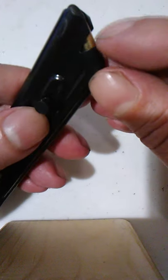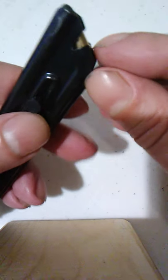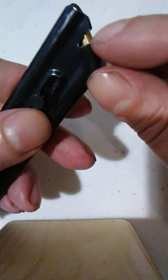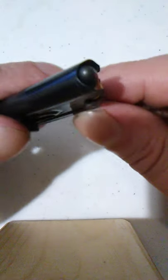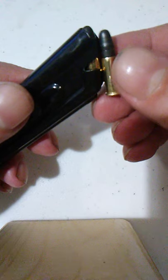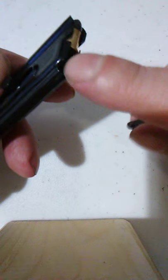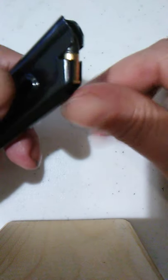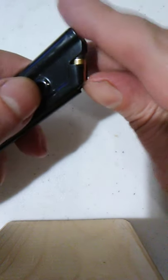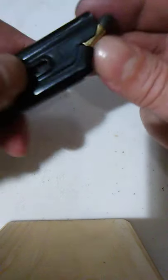Notice there's a little bit of ledge there. If you move it too far it'll pop out, so you want to keep it right about there — just a little bit further, like right about there. That should be fine. When you feed it in, it looks just like your other 22 rounds because we've taken care of that space. Without this, if it grabs the shell positioned wrong, it tends to pop it up too high from the feed ramp.